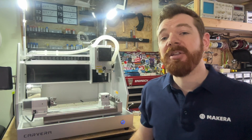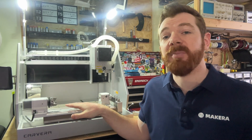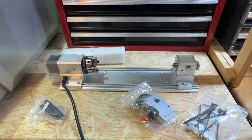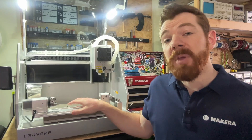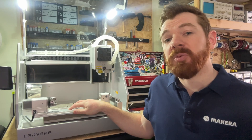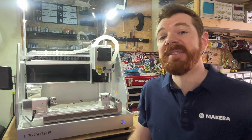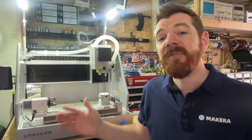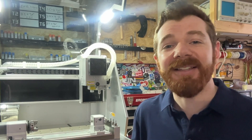In this tutorial we're going to look at how to install the new 4th axis module with harmonic drive as well as the wiring harness, which differs from the original for the Carvera desktop CNC. This step may vary depending on your machine as described in the user guide. To connect this 4th axis module, a new wiring adapter will need to be installed on all Carvera CNCs with a serial number starting with C1, while Carveras with a serial number starting with C1R will have this wiring adapter pre-installed.